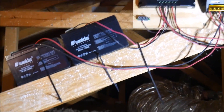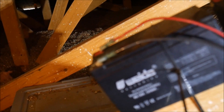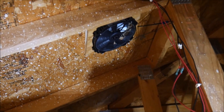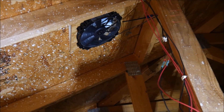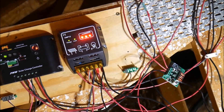That's been working really well. I check them a couple times a year and I noticed this past time that the negative terminals on the batteries are showing some corrosion. What that means is that they're undercharging. These batteries are probably too big — they're 8 amp hour batteries and the little 10 watt solar panel can't adequately fully charge them after a full day of running. So I'll probably install some smaller 5 amp hour batteries so they're not short cycling all the time.